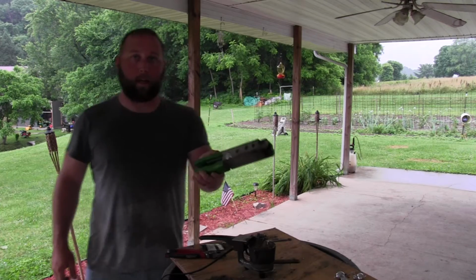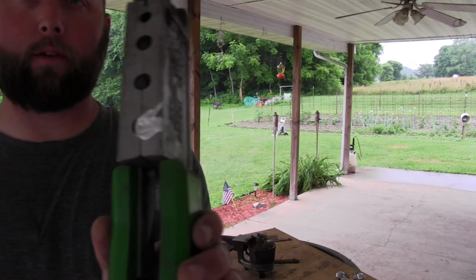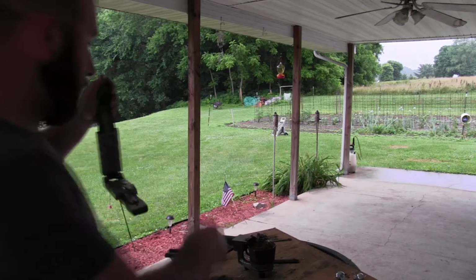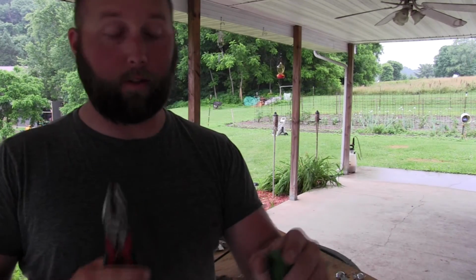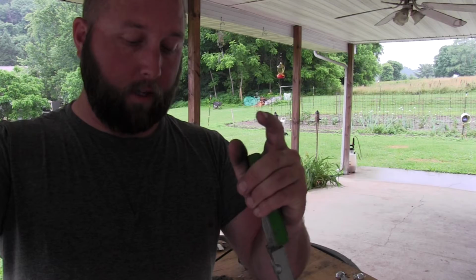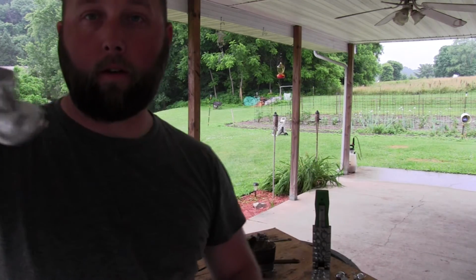In there. And again, what's going to happen is you're going to have some overpour. You're going to have what's known as sprue there. It's basically just an overpour. But what happens is, first off, do as I say, not as I do, wear some gloves when you're dealing with lead, because it's really, really hot. I have a pair of pliers here that I'm demolding, if you will, these things. They're extremely hot. But you can see I'm holding onto the sprue here.